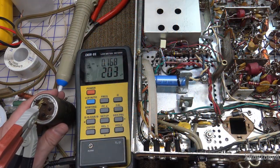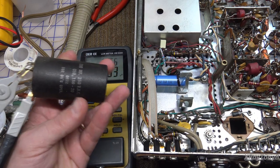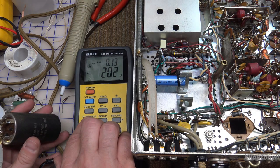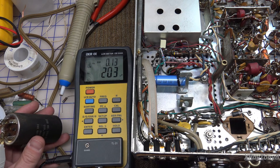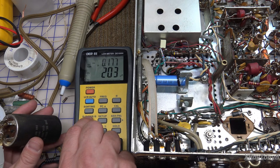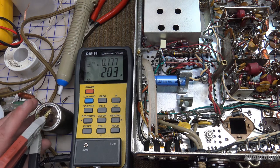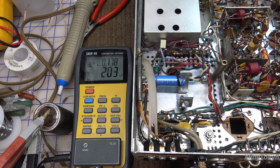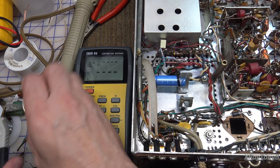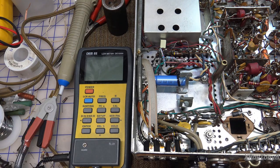Let's test it. This is a 200 µF at 250V — it's reading right dead on at 203 µF, so this cap is good. ESR is 0.13 ohms, which is pretty good. The dissipation factor is 0.177 — this cap is in really, really good shape. If you want to know what all that means, I did a review of another capacitor tester/LCR meter where we calibrated the meter and went through all of that — check it out sometime.